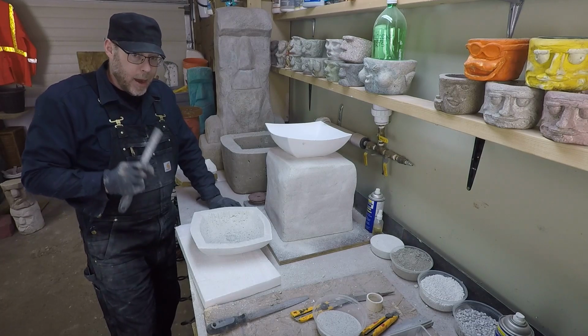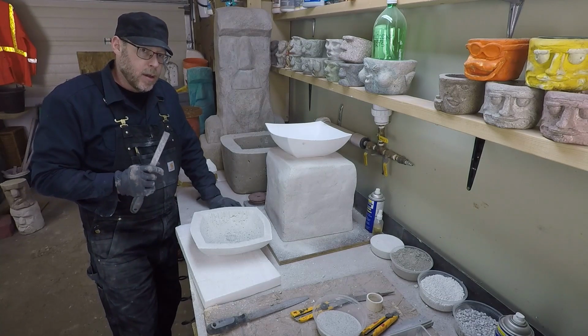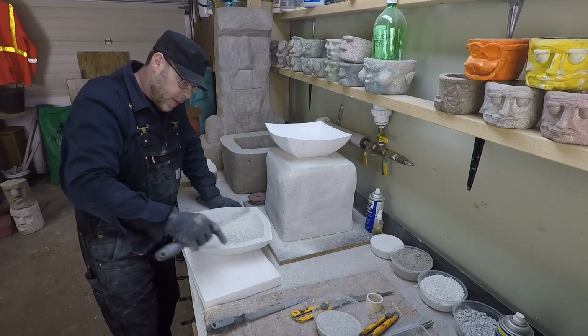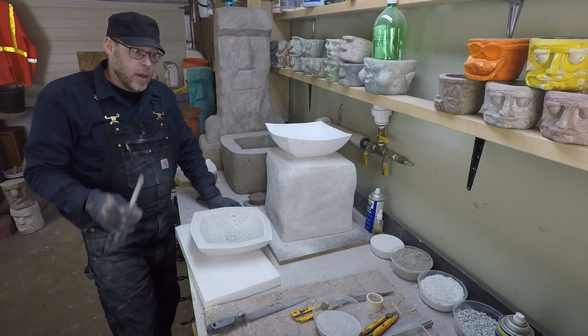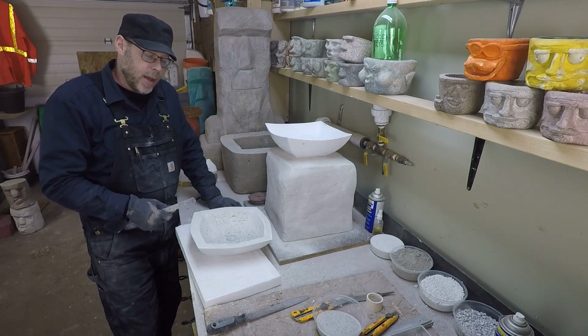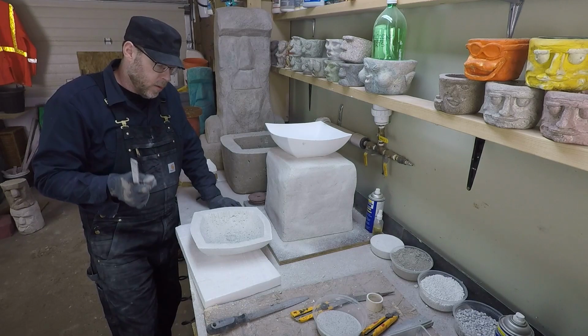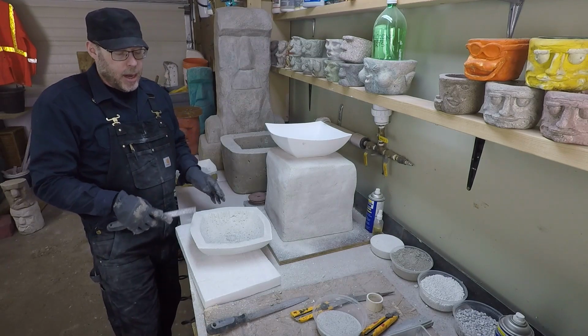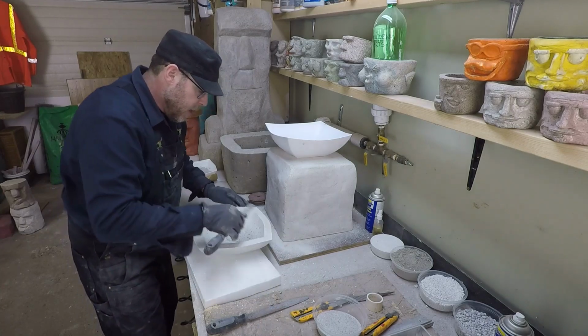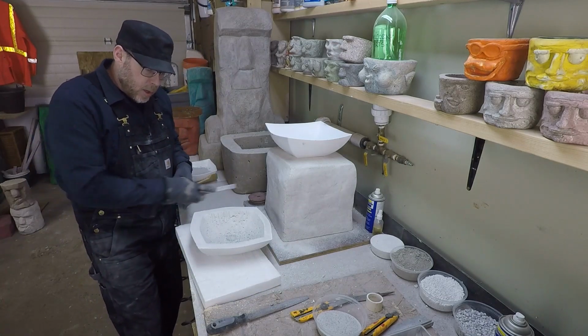And so you would buy, ideally, a variable speed grinder, a 4.5-inch diamond grinding cup, and then you would use that and grind that outside edge, probably outside, unless you want everything in your life covered with a 1/4-inch layer of concrete dust, which you probably don't. So that's the process that I would use. Again, what I've got here is just something that's flat. That's more or less what I'm going for.